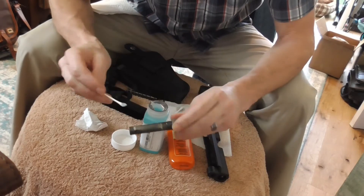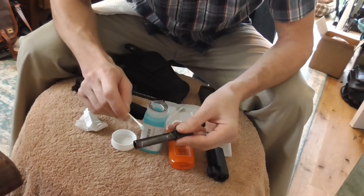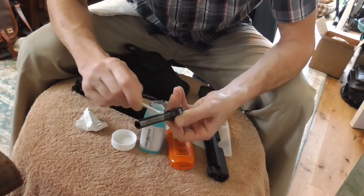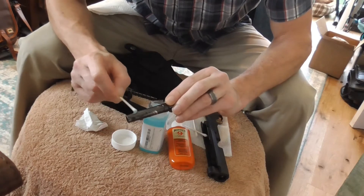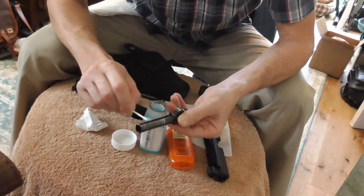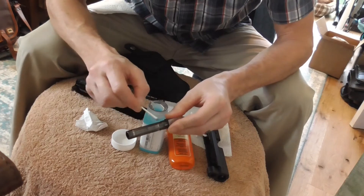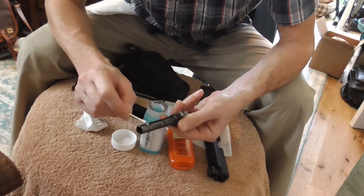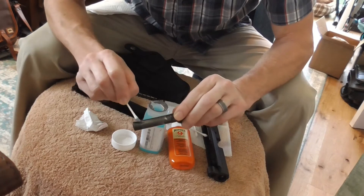Alright, see what's happening here? It looks like the stuff I applied to the top may have dripped around to the bottom and may actually be working on that part. For some reason that part seemed to work pretty good. Maybe I'm not getting it soaked enough or letting it sit enough. See where the drips are accumulating? Where the drips are accumulating it appears to be bluing — because it's gobbled up on there. You need to really let it sit on that metal and suck into it.